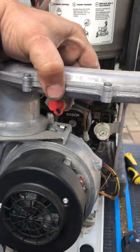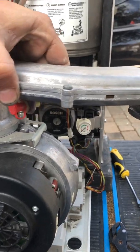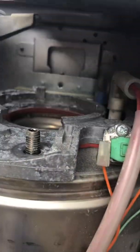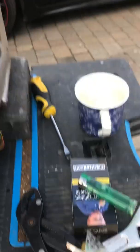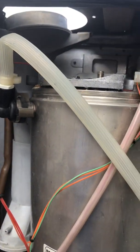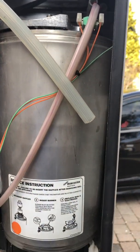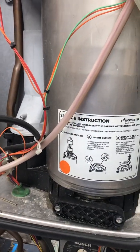When you first see it, it looks difficult, but it really isn't. It's a case of just taking the fan connections off, taking the gas union off, taking the nut off, moving the little locking plate, and pulling it — twisting it anti-clockwise — and then just lifting it out. So that's the burner removed.